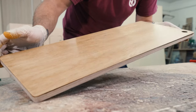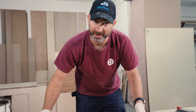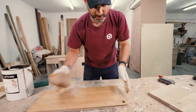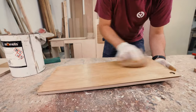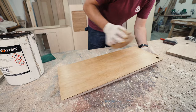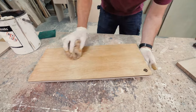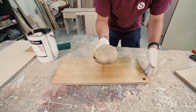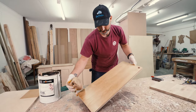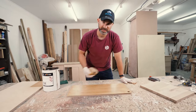That's all it needed — just taking the little excess off there. It's got a really nice uniform shine and it's really brought out that grain nicely. The last stage of applying that wax layer is to get your T-shirt or rag, form a nice ball surface, and give that a buff. The gloss level of sheen is changing and you can see the waxy layer has come up really, really nice and evenly. With the door finished, let's move on to the worktop.